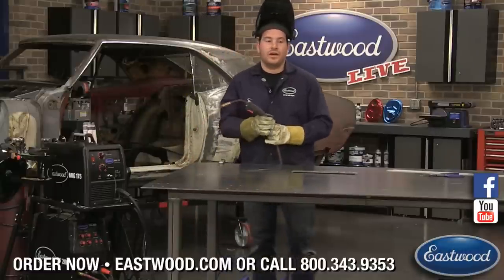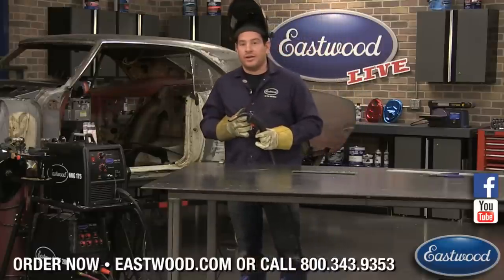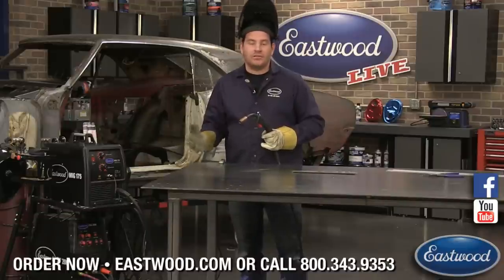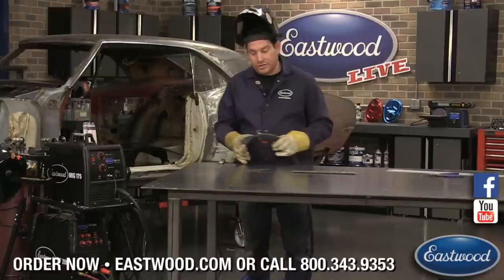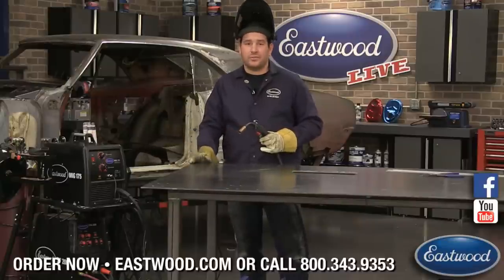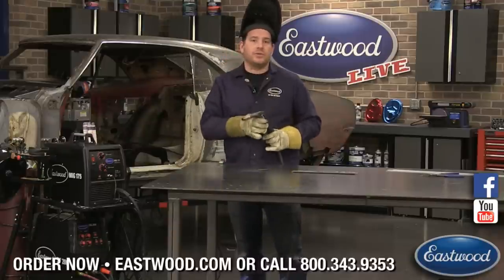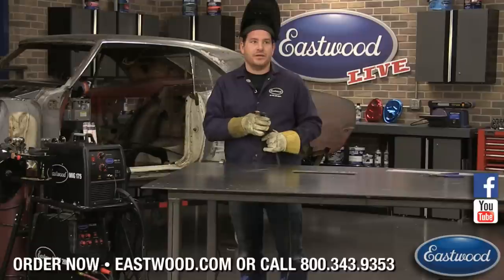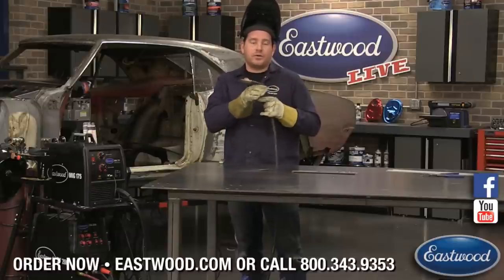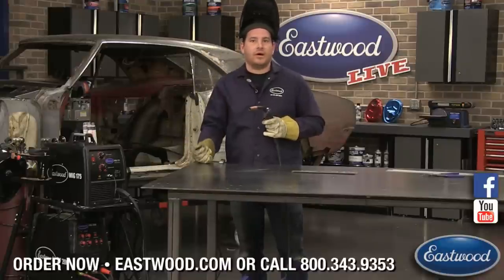The first question was any tips for welding vertical. The one thing to always remember when MIG welding vertical is you're fighting gravity. You've got to move a lot quicker than you would if you're just welding straight on the table. It also changes your welder settings a little bit. I tend to like to put my wire speed a little bit higher, and I like to weave the puddle back and forth when doing any kind of vertical welding.